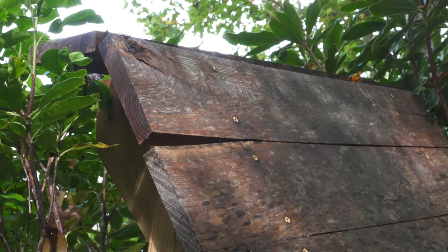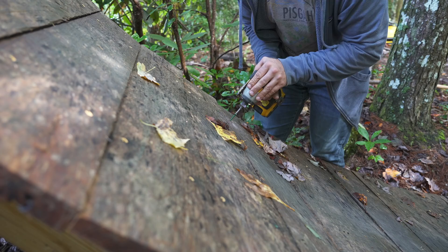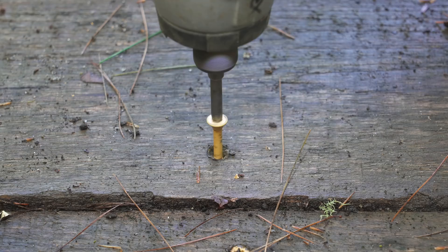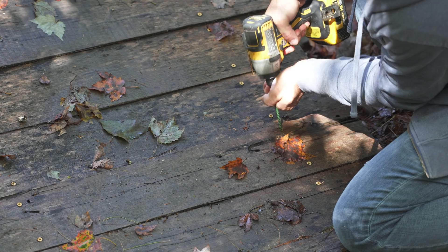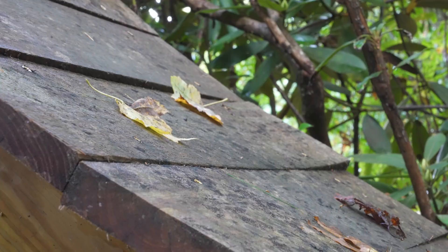This is a chance for me to geek out about some of the hardware here because I do get questions. I've decided that a two and a half inch screw is really not enough — we've largely switched to using three inch fasteners for almost everything here. What's weird is both screw heads have just snapped. Anytime I see one of those boards, I'm finding the snapped screw heads. This is very concerning. One way to prevent this in the future is to make sure they're spaced out — I'm going to angle this into a different part of the wood. You always have to space these planks out a little bit or you're not making any room for movement, and if there's no room for movement, something's got to go.